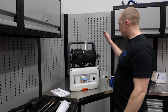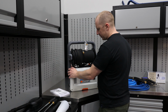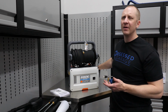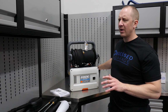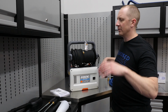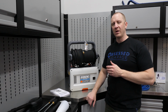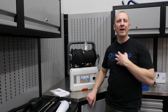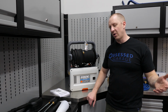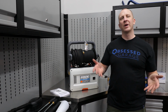All right, so first thing, testing. I was able to achieve 1.9, it was 1.89 gallons per minute at, I believe, right around 1000 to 1100 PSI, so 1000 PSI. And I know some of you, your heads are exploding who haven't watched other videos on pressure washing. For your car, this is my subjective preferred pressure. I'm washing a car at around 1000, somewhere between 900 and 1200 PSI is what I recommend.